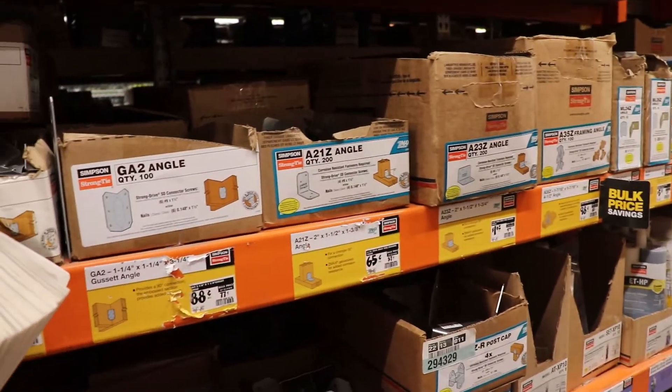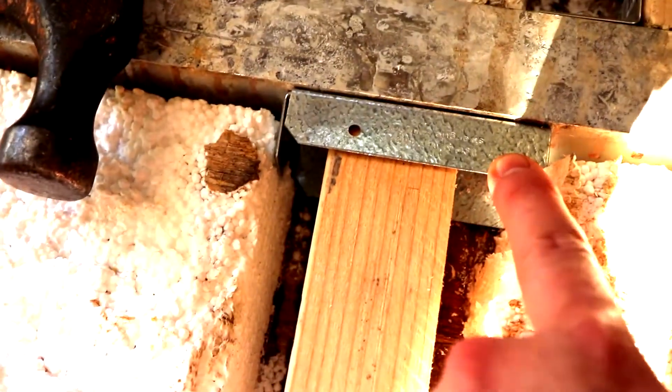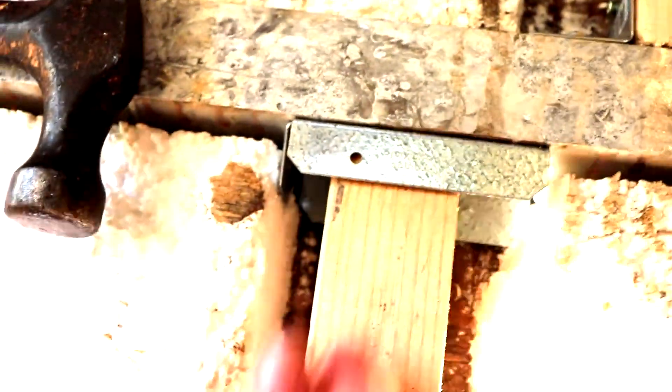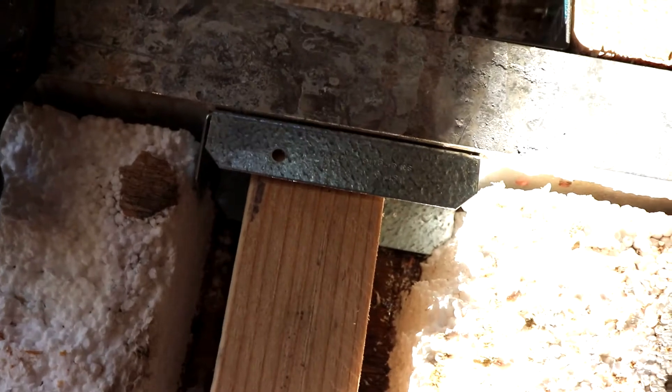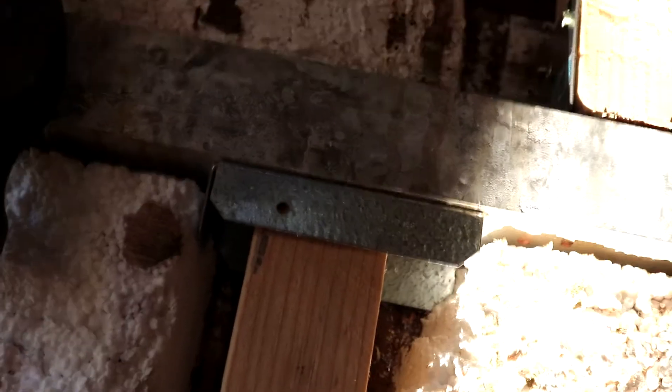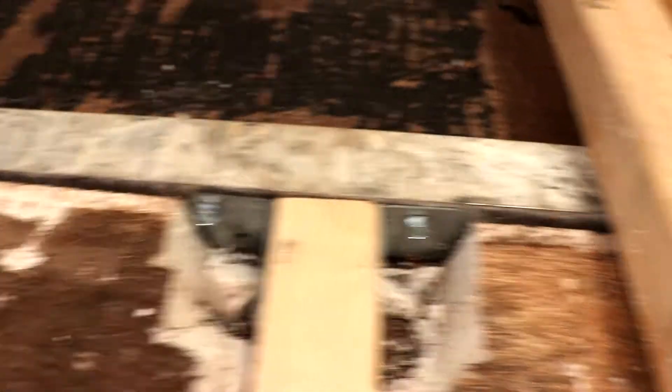We need about 30. These were the first clips I was using to attach the studs, and what I didn't like about them was that this little piece of metal here — if the wood was flush with the aluminum, this piece of metal would come out above the aluminum, and it really needs to be flush. So when I put those in, I had to hit that top flange with a hammer. Then I switched to these L brackets — see how that's installed? The wood's flush and nothing's sticking out above the wood.